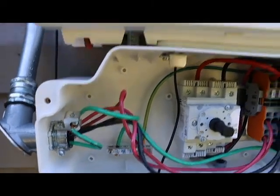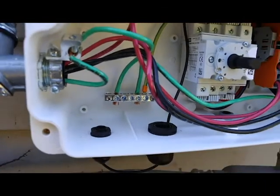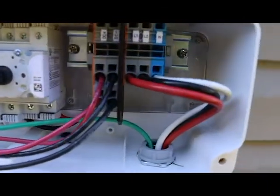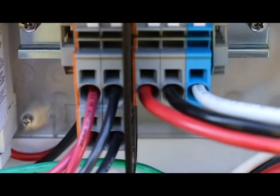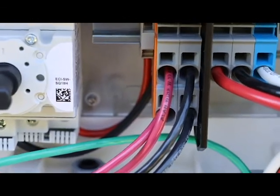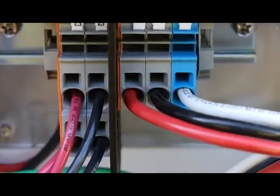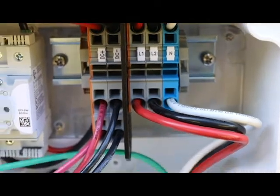All right, so here we go. We've got the new inverter up. We have the monitoring antenna — I put the monitoring thing up top there. I've connected my grounds and all my wires again. You'll notice I don't have any wires sticking out. Sometimes you'll see little pieces of metal wire strands sticking out — that's a no-no. I've got all of this and it matches: red, red, black, black, white, white. Super easy.